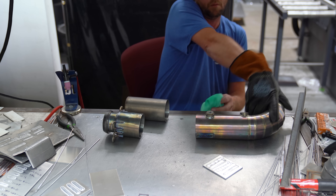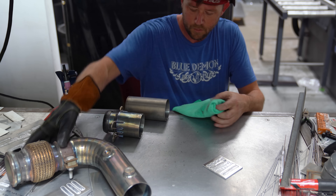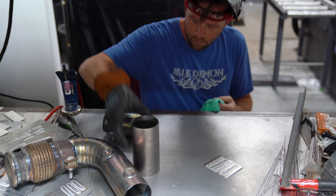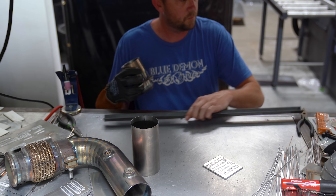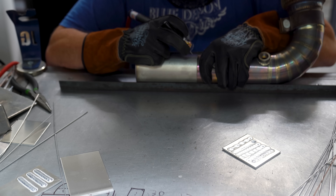In order to keep the tube straight, I used a piece of angle iron since the shape keeps the tubes in alignment with one another — it basically prevents them from going all crooked. Admittedly I was being a little lazy and should have cut the angle down to make it easier to work with, but I managed to use it for the time I needed it. My fit-up game is usually pretty strong with stuff like this, so it's hard for it to go crooked.